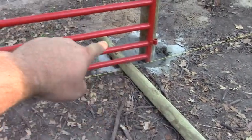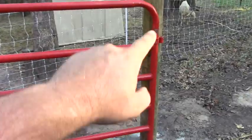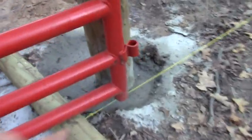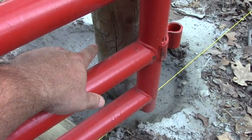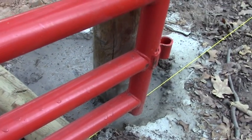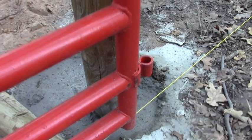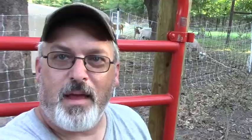So what I've got so far: I laid a round 4x4 pole down here. I've got one on this end. That's just going to give me some height off the ground. At this point I'm not concerned about level — I'm going to show you how I level that with the hinges. But this is my starting point. The first line that I drew is a stationary hinge point. I'll show you that here in a minute — that's where I'm going to drill my first hole. I'll set that hinge bolt in there and then we'll mark for where this hinge goes. This is actually a movable one, and having that mobile is going to be pretty important. I'll show you that once we get to it.